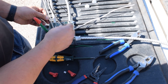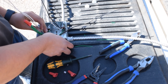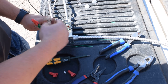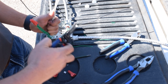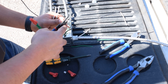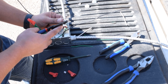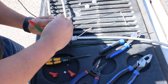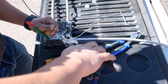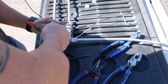Next I'm going to go with all your neutrals. Kind of stick them in the same line, just right next to the ground, create like a little 90 on each one. Once again, six inches. I usually like to do a thumbs up sign, cut it off — another fingernail length. Bring them all to the same height, pre-twist. Make sure it's nice and tight, nothing falls out.